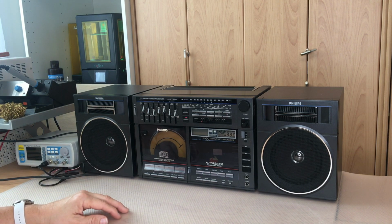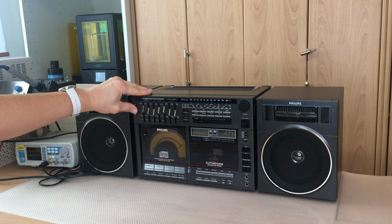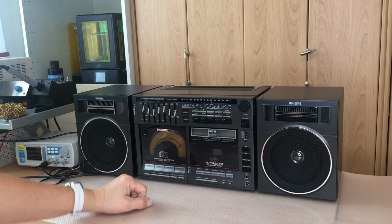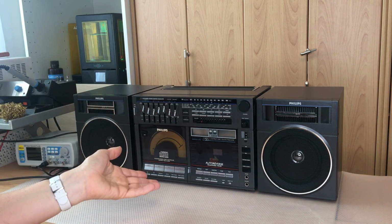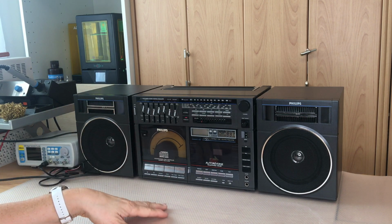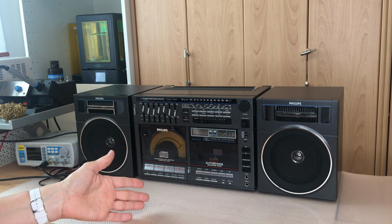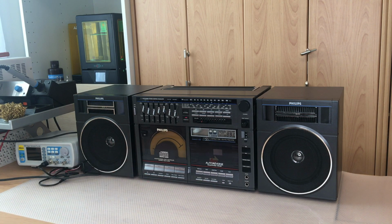Well, that's easy. The power LED is lighting. There might also be an issue if the power LED is not working. You can find it probably on the website in the first aid section. So what we can tell now is that at least the tape deck CPU is not working, and all of my 3 items had the same issue. So we don't know if the tape deck CPU is just frozen, if it hangs, or if there is a supply voltage missing or something like that. But we will see.